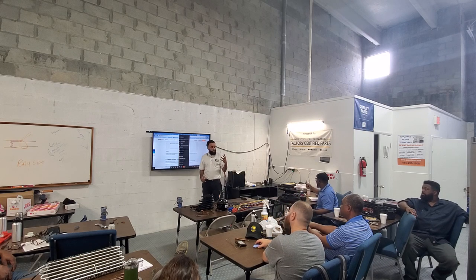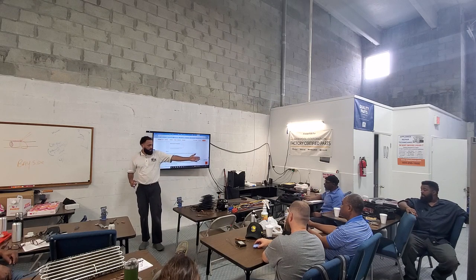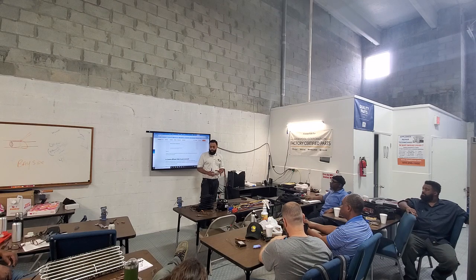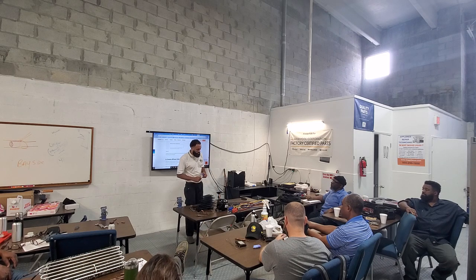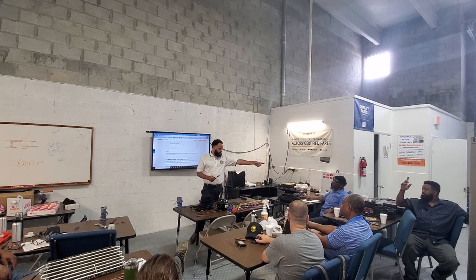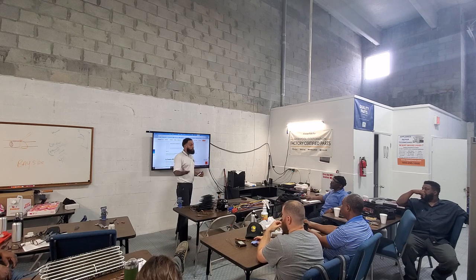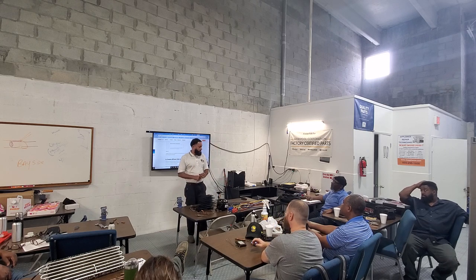I've mentioned the four most common failures associated with sealed system problems. Can you give me one, sir? I've given you guys four of the most common sealed system failures. Give me one of the most common failures of a sealed system. Low temperature, low freon. What's that called? Restriction. No. I'll take restriction. When it's low on freon, we said that's called what? Low charge, or undercharge. Undercharge, low charge, it's not up to specs, right?